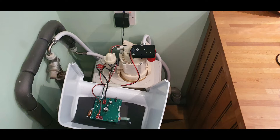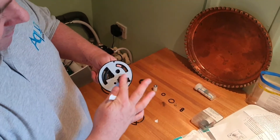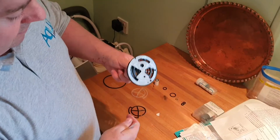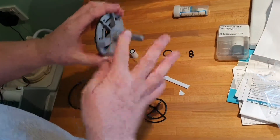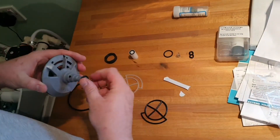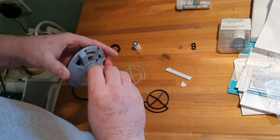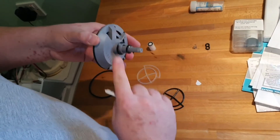We take the top shroud off and expose all the insides. What I like to do first is get all the new parts out ready, get them all laid out so we know that nothing is missing. I put silicon grease on all the surfaces because these are moving parts and we don't want to be catching or snagging them. This disc kit here — I've got the disc in my hand now — we're going to put the two o-rings on the top. They are neoprene o-rings, so let's put some silicon on them and make sure they move nice and freely.